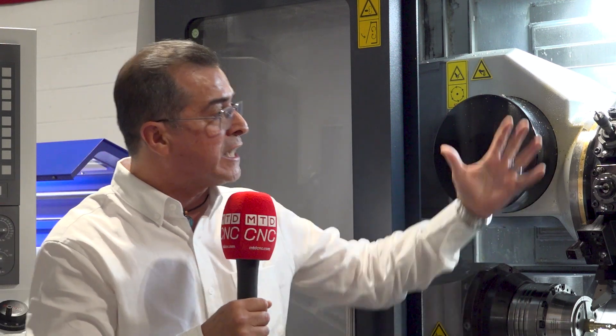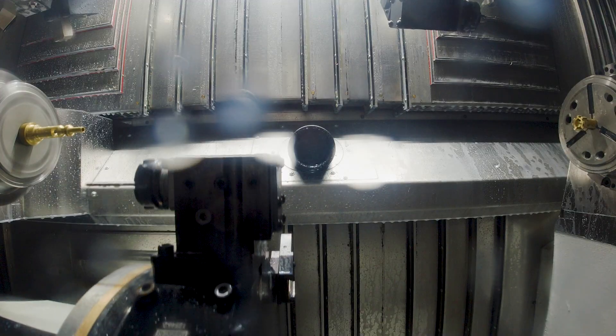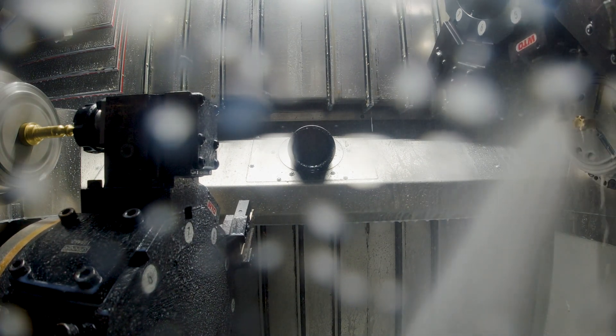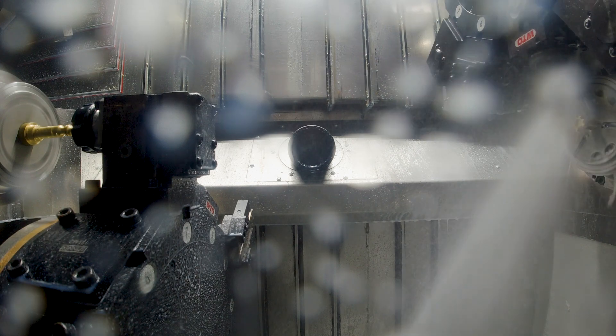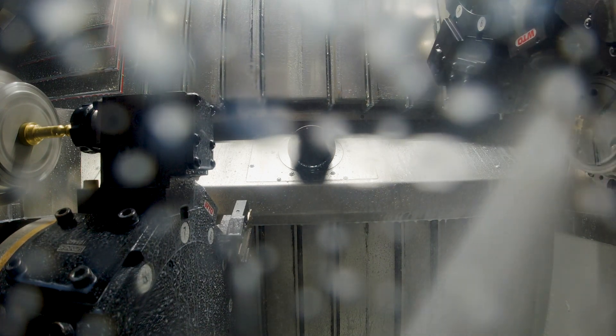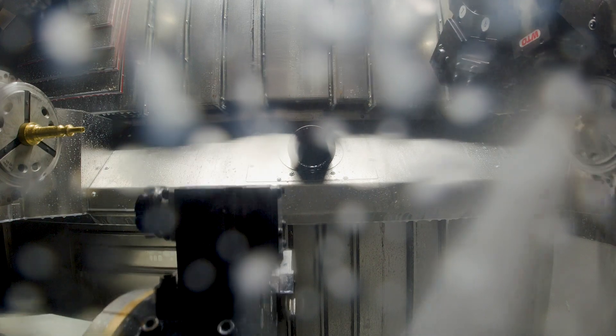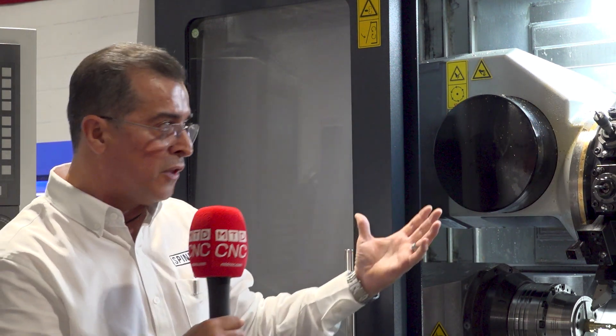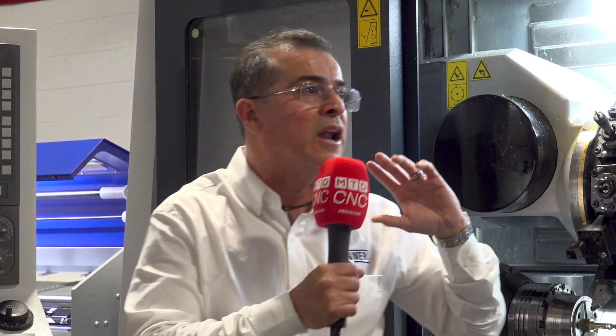The uniqueness of this machine is how it's built. As you can see, this is not a slant bed lathe or multitasking lathe — it is vertically built. That allows for chip evacuation; you don't get chip problems on it. Our chip conveyor is wide — it's two feet wide. And the way the machine is built, you can have all three turrets working on one spindle or the other. They're not exclusive. Some other builders have one turret that can only work on the right and the other only on the left. On this one, we can share turrets whenever needed to make it a lot more efficient.